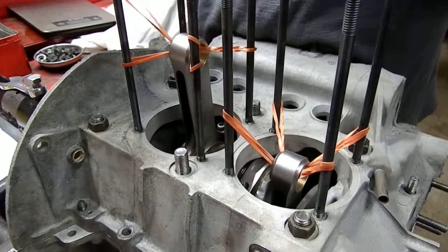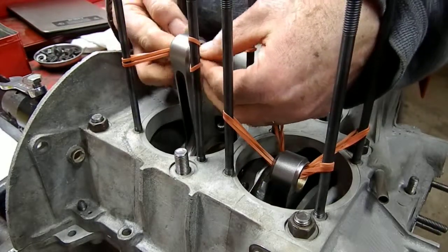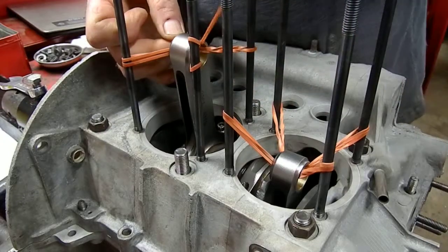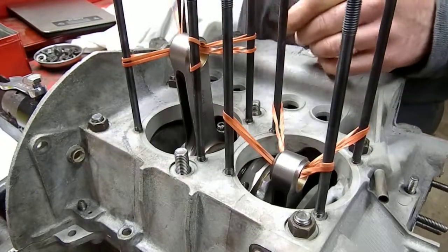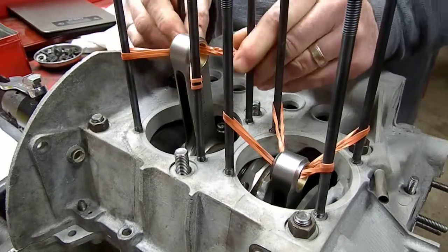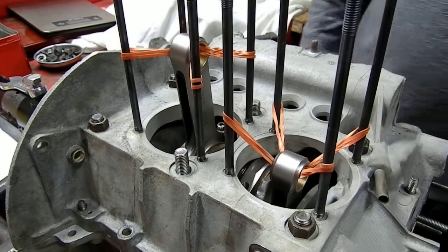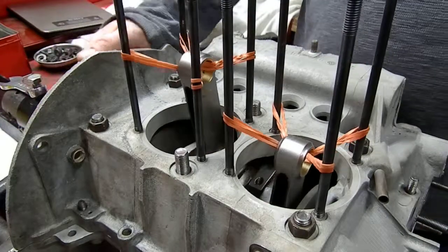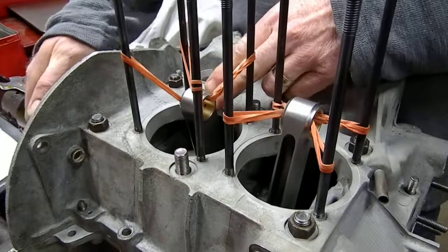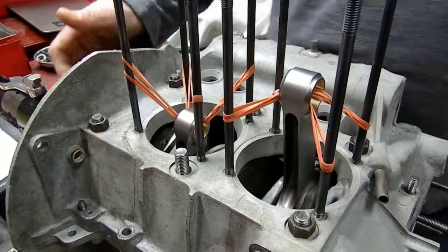So it's really important, especially when you're using an OEM block, to make sure that you don't have any clearance issues, because if you buy the $1,500 Scat block or MP block or whatever, then it's all clearance for you, and it's meant to take these real big stroke crankshafts. Well, this little stock AH case is not meant to have an 82 millimeter stroke. So you can see this is going to keep us pretty well right in the center of the center line.